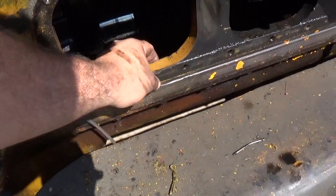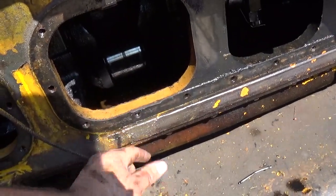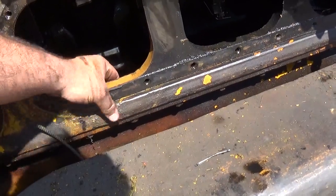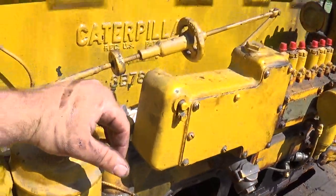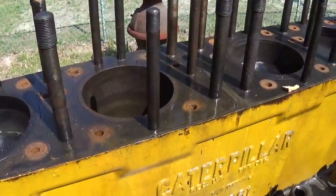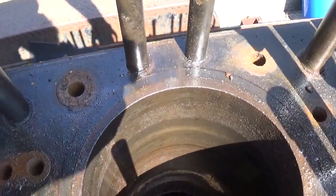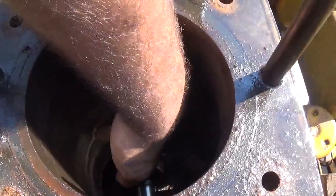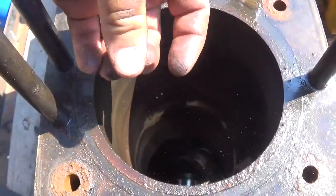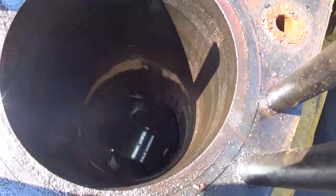I was a little concerned about applying that much force to this area of the casting for fear of breaking it, but this is a solid one-inch-square casting on the crankcase — actually it's bigger than that — and then you've got the oil pan reinforcement. I didn't have to exert too much force on the end of the lever to actually get it to move. Here's number four cylinder bore after I just removed the piston. Haven't even tried to clean it yet — you can see the dry spots on there. It had been soaking for a while and there are still points where no lubrication got to, but it did slide out. I'll clean that up and see how bad it is.